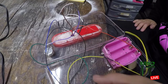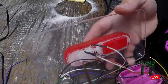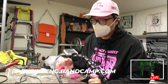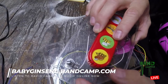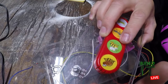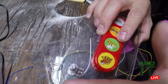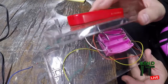So really today I'm just gonna finish up this circuit that I was installing last time, which is a volume control circuit. It does so by way of what is called a voltage divider. So the signal has some voltage and how much it is being divided by the resistor is chosen by the knob, which inside this potentiometer, there's a little strip resistor and a dial that contacts it, and as you rotate, you're selecting basically the smaller resistance out of two pieces. So that's how that works, and I'm going to finish installing that and repair my bend.